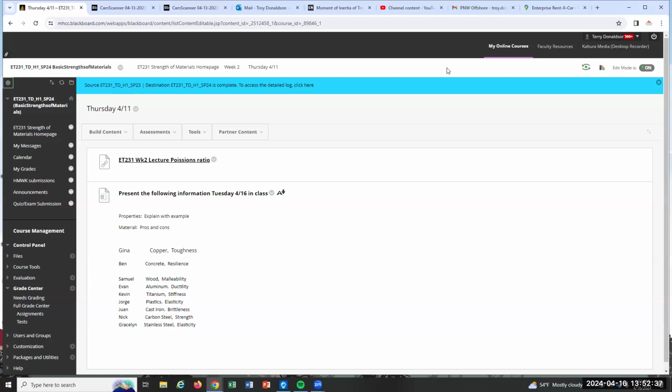All right. What about brittleness as your material property? Yeah. So brittleness, if you put a load on something that's brittle, it'll keep going up its stress-strain curve and just blow up. Yep. That's exactly right. It doesn't deflect real well. No plastic behavior.